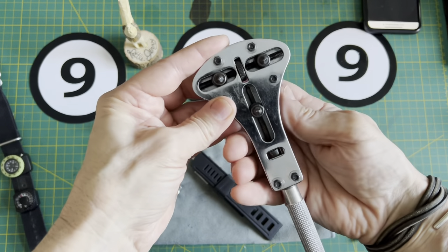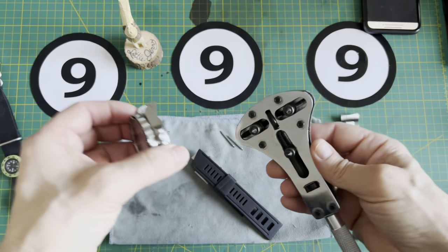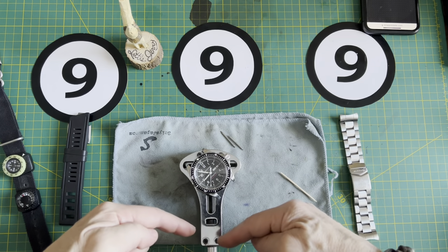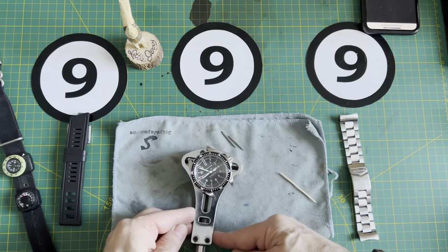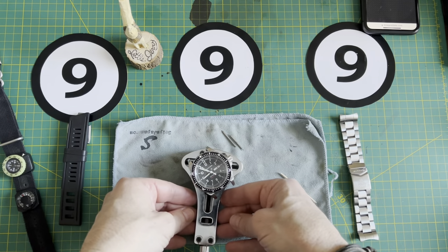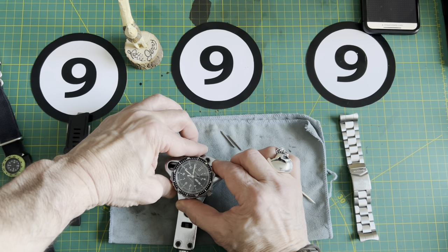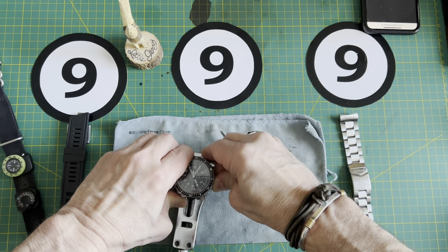Let's bring over this tool again. There's another little trick I did here because I don't have a vise or clamp for the watch. What I've been doing is holding it upside down — the ghetto version — and it does work. I get the bar sticking over the workbench, put my knee against it, and then just gently tighten. Right now I can feel the threads tightening up, and I'm putting pressure on the actual case of the watch, not on the crown, and gently pushing down at the same time. I think I'm satisfied with that.